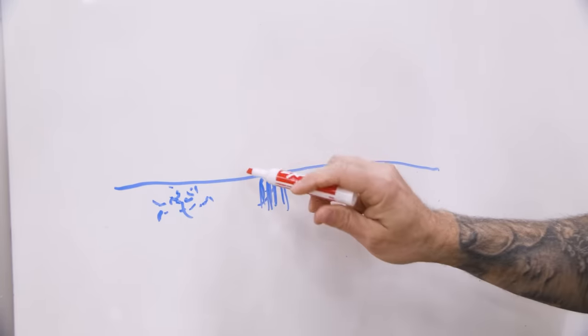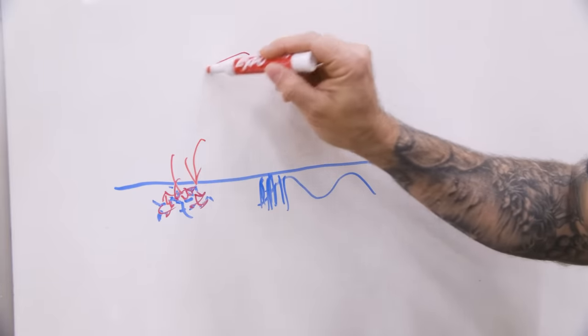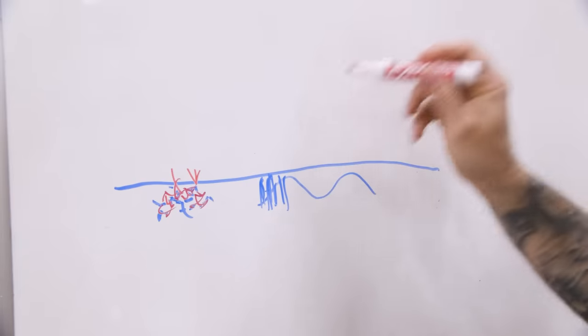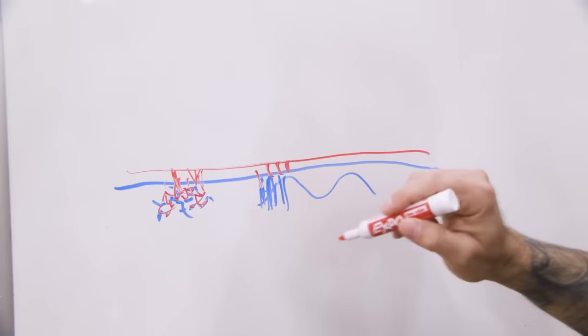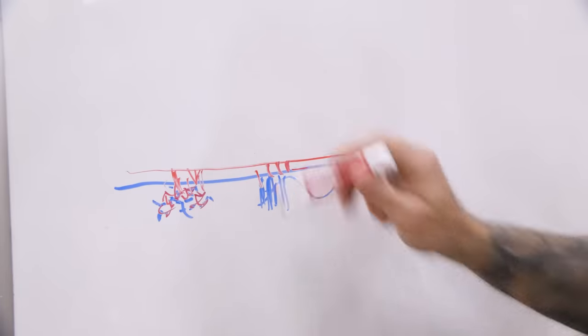When we do blotch prevention, what we're trying to do is even out the absorption across the surface. There are a couple of tactics. One is to preload these areas with something like mineral spirits — you pour that stuff in there and it pre-fills all these thirsty spots so that when you come in with your stain, there's not as much room to absorb. Another method is to put some kind of film-forming finish on the surface, something that will seal it partially. We're not totally sealing the surface, just enough to even things out — and you get mixed results with that, but it's definitely a tried and true approach.